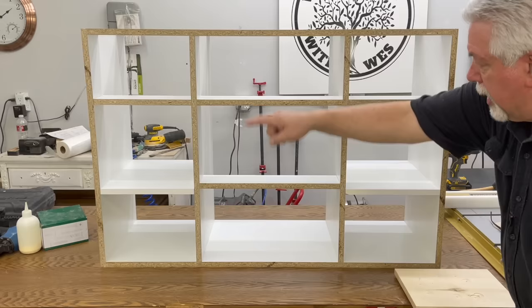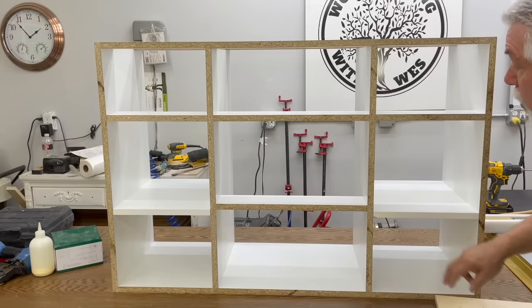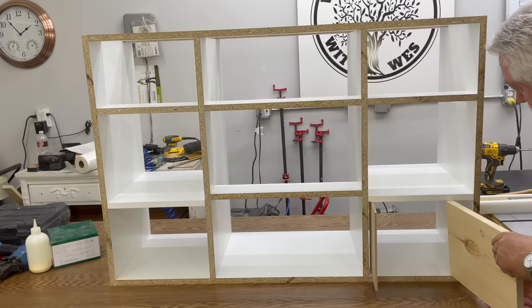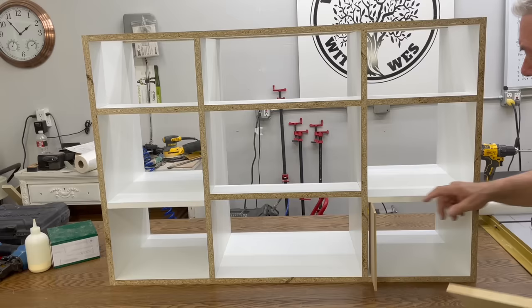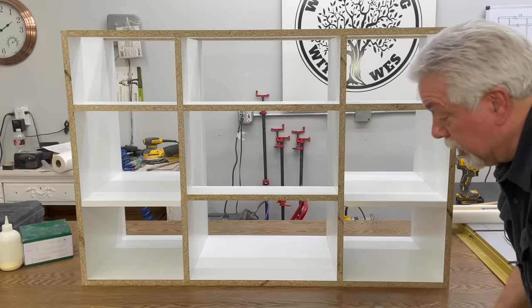I now have the box itself all assembled. As I was nailing it together, I nailed the outside of the box and then nailed in the two upright sections. To space down my top drawer, I made a little spacer block, and when I went to space my second block I did the same thing. I made spacer blocks to nail my shelves in — that is always how I put cabinets together. Whenever possible, I use spacer blocks because that keeps everything even and gives me a support to lay that piece of wood on while I nail it.